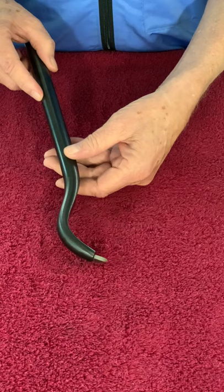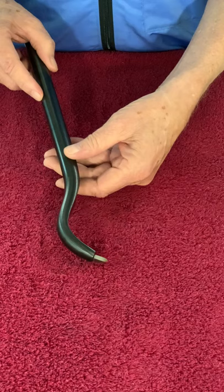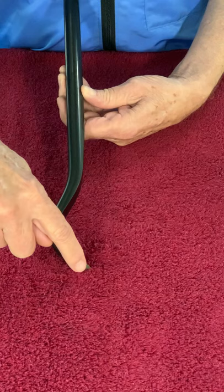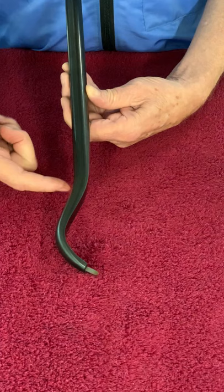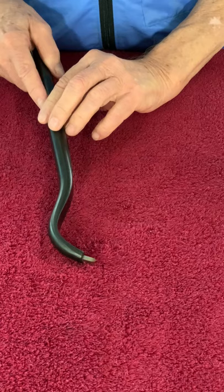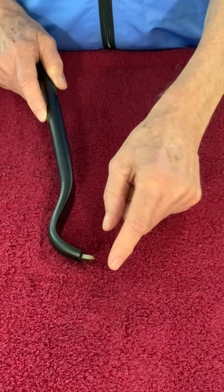The number one hook tool is the main tool, and along with the straight tool it's what I do 80-85% of my turning with. The way this works is that the tip is on the center line of the shaft of the tool. So as long as I have the tool rest behind the hook, there's no twist or torque on this tool. When this tip touches the wood it simply cuts — there's no yanking or twisting, no drama. It works really well and is very easy for somebody without experience to use.